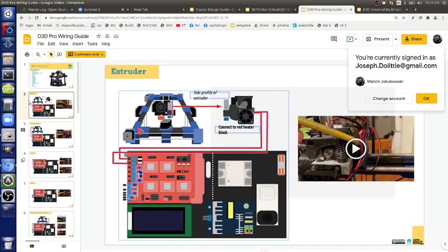So maybe if the axis is skewed, and in this build I actually paid a lot of attention to make sure my axis is super stiff. Because the Z axis can actually twist a little bit this way if you're not super stiff. So even though I tried to start the print nice and straight, maybe the axis bent out upon moving, and then you get skewed prints.